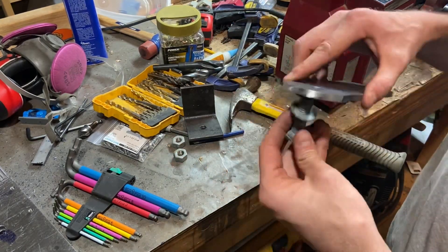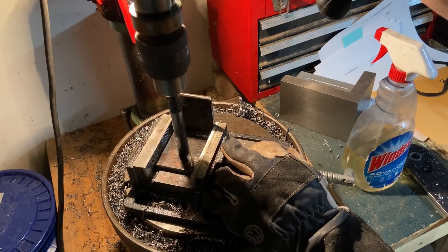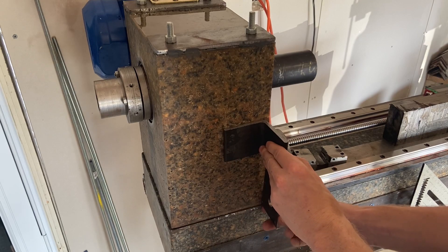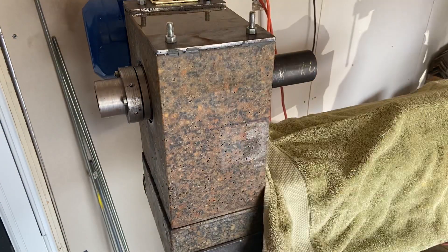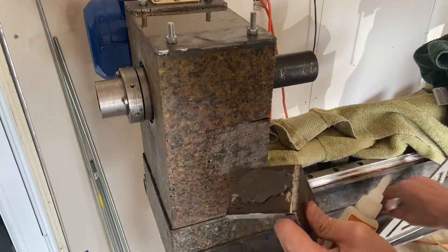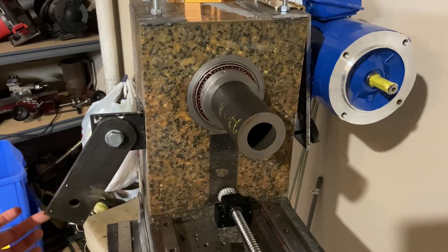Just checking that the bolt actually fits — and of course it doesn't. That's okay, I'll just widen it out. This actually turned out to be sort of a tricky hole to widen; the 5/8-inch bit really wanted to grab the sides of the hole and yank it all around, but eventually I did get it widened out. Now I've got the bolt in place for the hinge. I wanted to use a double nut instead of a welded nut so that way I can actually remove this thing if I need to change it. I'm marking it with my square to figure out where this needs to be epoxied, then I'll use some 5-minute epoxy and a little bit of super glue to hold it in place. It turns out that super glue is not as fast without the activator, so I sat there for about 5 minutes just holding that thing on there as a human clamp because I couldn't reach any of my other clamps and I didn't want it to drop.